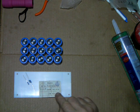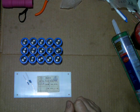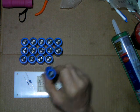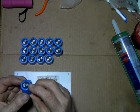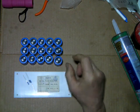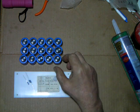You want to start out with using 220K ohm resistors, half watt. Around each of the legs of each cap, give it a single twist — make sure it's good and tight, a clean connection — and then solder it. The leads of the resistor are what we'll use later to tie these in series.